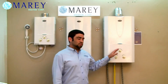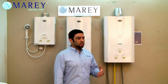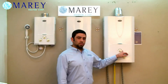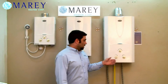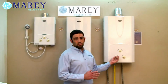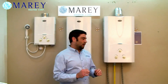There's 3 rows of burners inside. On the winter setting, you're going to have all 3 burners lit, and that's for when you have colder incoming water temperature. But in the summertime, when the incoming water temperature is a little higher, you're able to switch it over to summer, and you're able to heat the water with less propane use. It even allows you to dial in exactly how tall you want the flame inside of it by being able to adjust the burner setting here to even get a more specific heat that you like.